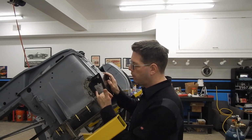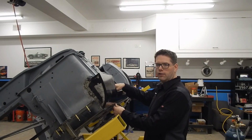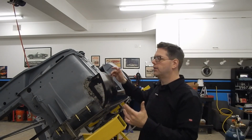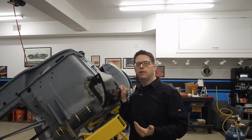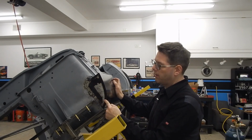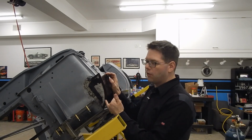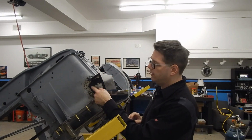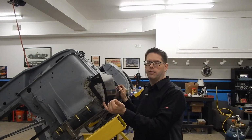The only thing that I would say with the spot welds, you want to get your spot welds nice and tight. Anywhere you're along here, it's fairly easy. On the flanges here, you can use the locking pliers. That'll be no problem. But when it comes to this piece up here and our piece right here, it's going to be a lot harder to get locking pliers on that to push the panels together for your spot welds. So what you can do is go ahead and use your clecos for that. So we might drill through, use clecos to pull the panels together. Definitely on this, after we put our holes in, we'll go ahead and selectively drill. So basically what I'll probably do is punch the holes, decide which ones I want to put clecos in, mark them when I'm in mock-up, take the panel off, and so I don't bend and mangle this, go ahead and drill through them while it's on the body. And then I can use clecos to sandwich these panels together.